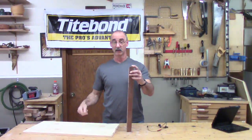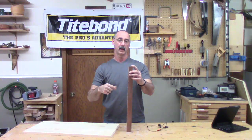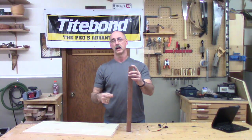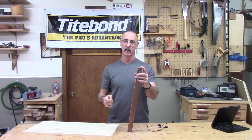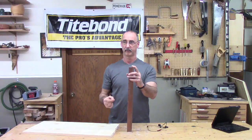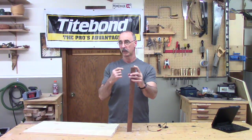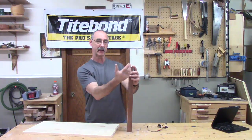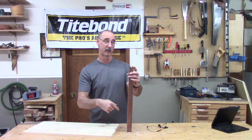So hopefully the first thing you're going to do is put rails from leg to leg to leg to leg. And then once the rails are on there, or prior to putting the rails on, bamboo plywood top or bamboo top? I think it said bamboo top. Hang on, let me see. Well, I could just qualify the answer. If it's a man-made material, you could use pocket holes in the rails and then use that to fasten the rails to the top.